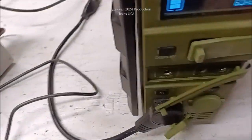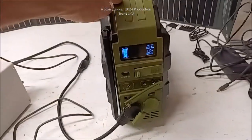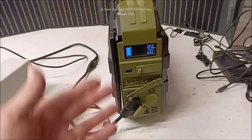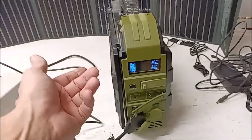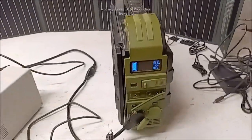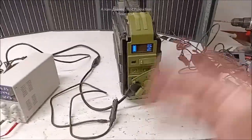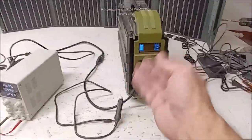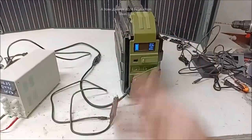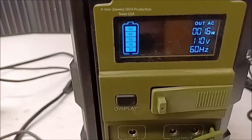This little Browey — I never thought when I first came out here and hooked it up. I'm like, okay, she's fully charged. I left her sitting in the seat of the truck. This sat in the seat of my truck with the panel up and charged itself — wasn't even plugged in. It was at about 50% and it got cold outside, down to like 17 degrees. It won't charge at low temperatures — so it shut itself off, didn't try to charge, and then came back on right when it got about 38 degrees and lit up again.